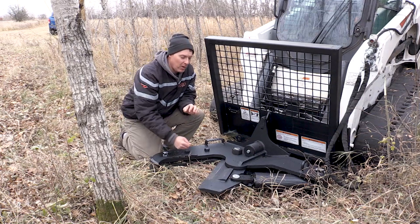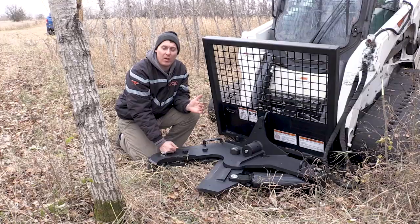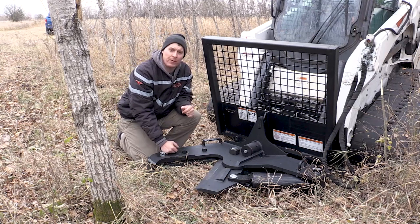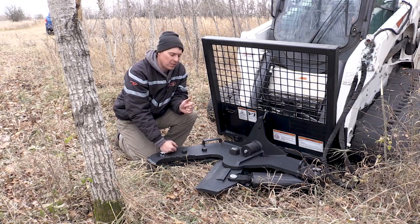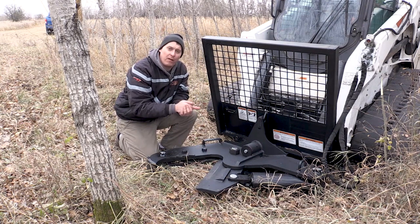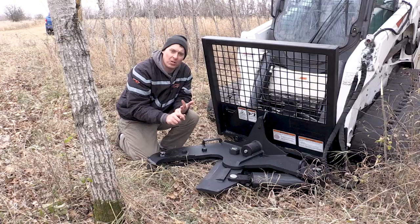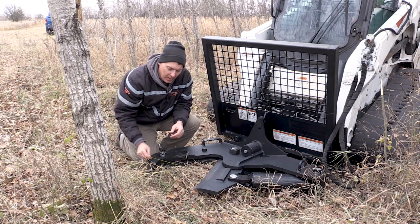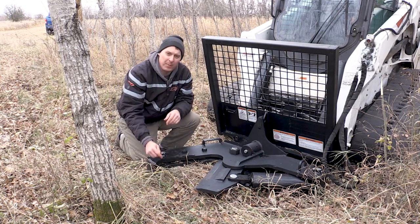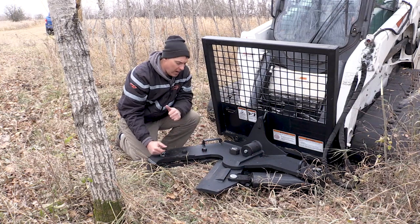To start off with, we use a very large cylinder. It's a 5-inch diameter cylinder with a 12-inch stroke. At 3,000 PSI, that provides about 59,000 pounds of force at the cylinder pins. We're pushing a 1-inch thick blade made out of high-strength AR400 — not only for strength but because it's abrasion resistant, it's going to last longer. The opening at the jaws is about 14 and a half inches tip to tip, so you can get about a 12-inch tree into the jaw area.